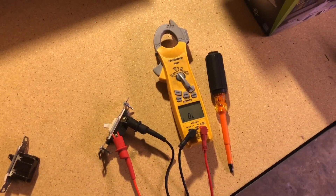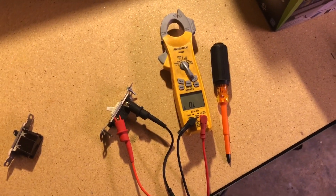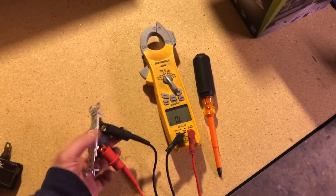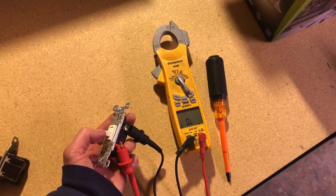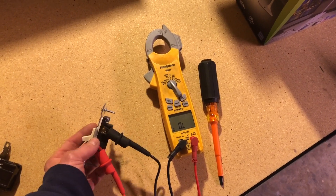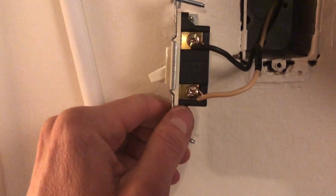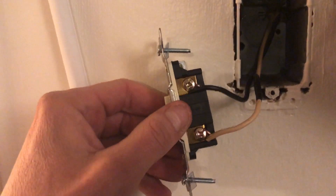You've got to remember, you're only breaking one line upstairs just as an emergency to kill the power to the furnace, boiler, whatever you've got. Just as an emergency — god forbid anything was happening, like the thing was on fire or blowing up down in your basement. That's why they put these switches upstairs, so you can run to it if there's ever an issue. Here we are, new switch in — just breaking the line, breaking the loop.